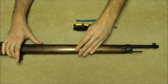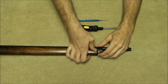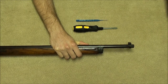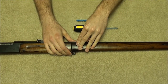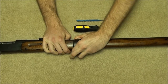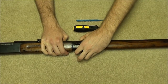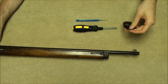Next, deal with the barrel bands. Take the front barrel band off by pushing down on the spring and wiggling it until it comes loose. Rotate it around so you can fit it out from over the front sight, and put that aside. For the rear barrel band, do the same thing — push down on the spring and wiggle it forward. This one can be a bit trickier because you have to push it over the whole spring. Slide it off and take it out from over the front sight.